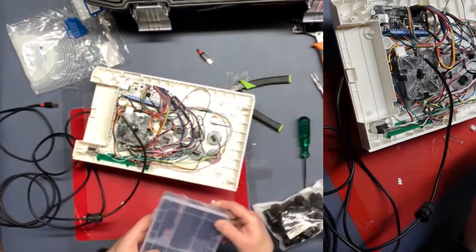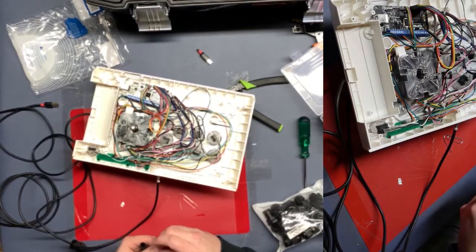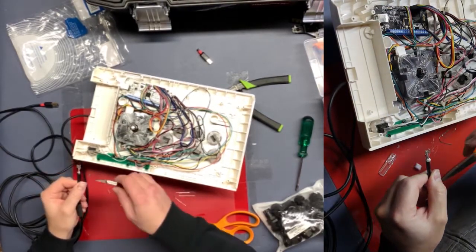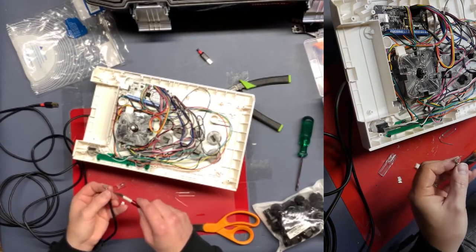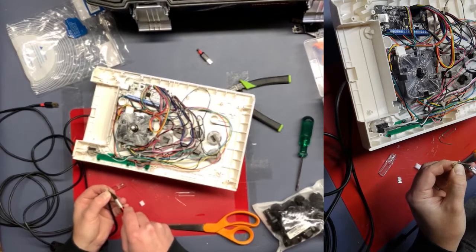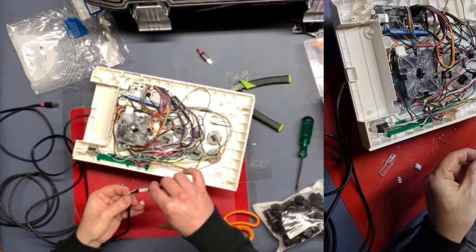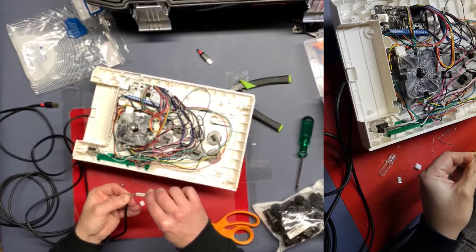The other thing I need to put on here before I put on the housing is some shrink tubing. Before I put these back into the housing, those tabs that I smashed down with a paper clip — I have to pop them back up so that they lock into place when I slide them into the housing. I'm just using an exacto knife, going under those little tabs and popping them back up just a little bit. These are what catch the wires to hold them into the housing when you slide them in, so they've got to be up to go back in to catch. Otherwise they'll slide right back out.